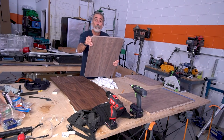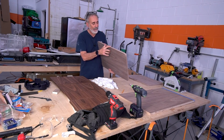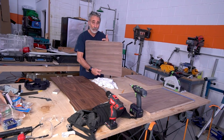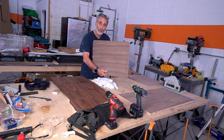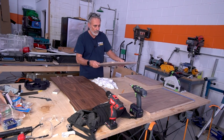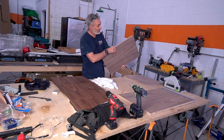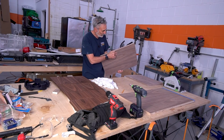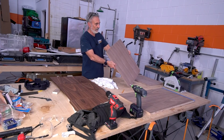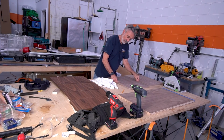Edge banding was the tough part, to get that edge bander to go all around. You get 1 shot at it, and you know what? I can't even see where the seam is. I mean, you have to start the edge banding, go all the way around, and then end it. Cut it, glue it, sand it, fill it. And to be honest with you, I cannot see the seam. Where does this edge banding start and end? Jeez. Nice.